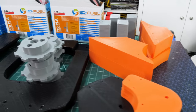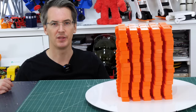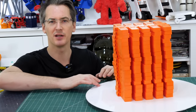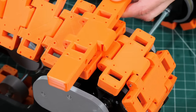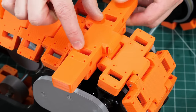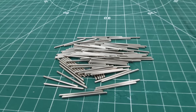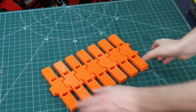There are quite a few big chunky parts for this project — in fact there's too many to fit on the table this time. That doesn't include the 80 track links that I need to put together, so I'm going to start by assembling some of those. The track links are really similar to the last Mobius tank — the sprocket spacing is still exactly the same but I've just made them longer so they touch the ground in the corner. I'm using 3mm stainless steel rod to make all the links and these have already been cut and deburred.